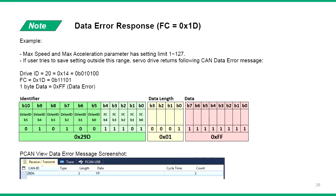Note that each command has an allowed data range. For the save max speed and max acceleration command, the setting limit is from 0 to 127. If the host tries to send any parameter or position command outside the allowed data range, the servo drive replies with the data error response as shown.